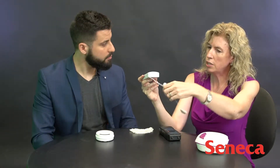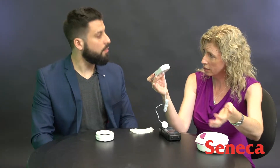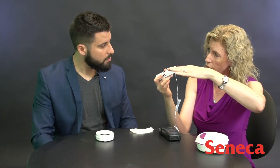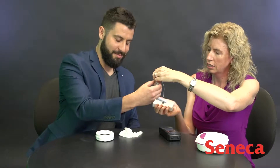The flat sensor is good for floor-level detection, but something like this hanging sensor works well if you need the sensor to go down a little bit — say into your sump pit. You've got the sump bucket, your float, and wherever the maximum level of the float is that's supposed to trigger the pump to empty — put this sensor just above there. It's got a little suction cup.